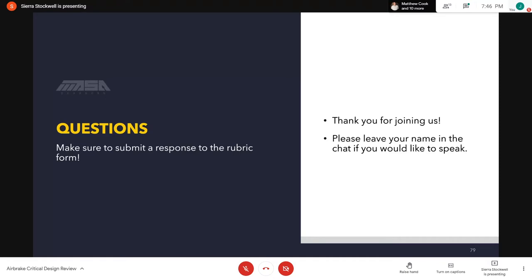Yeah, and also, another thing, currently with how we have it set up, it would have to pulse five times in the same direction to actually equate to a full step. But we don't really care about full steps for what I'm talking about. We're just talking about the error in general. Okay. I was basically just going to say, if it doesn't step the five times, we know it hasn't actually moved that position. Yeah, I think we can definitely talk more about how we can minimize that during electrical meetings later on, especially once we can actually get more of a physical test.